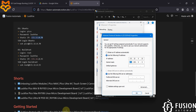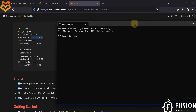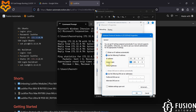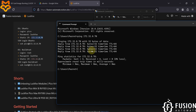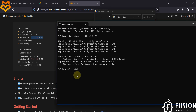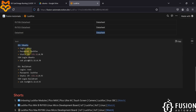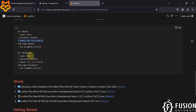Open Command Prompt and ping 172.32.0.70 to verify connectivity. We're already getting ping replies since we configured this previously. If you can't ping the device, the IP configuration step is mandatory to put your system in the same network as the LuckFox Pico Pro Max. Once ping is successful, the Ubuntu OS is running on the board — 172.32.0.70 is its static IP for Ubuntu.